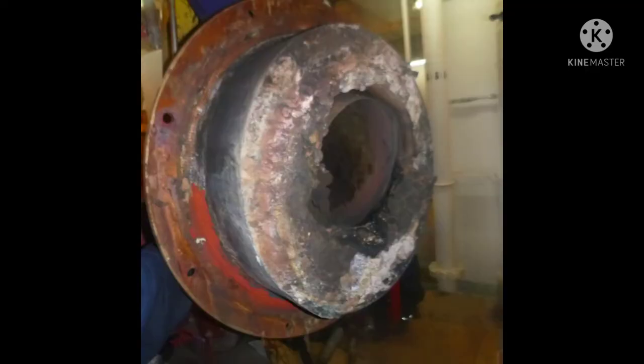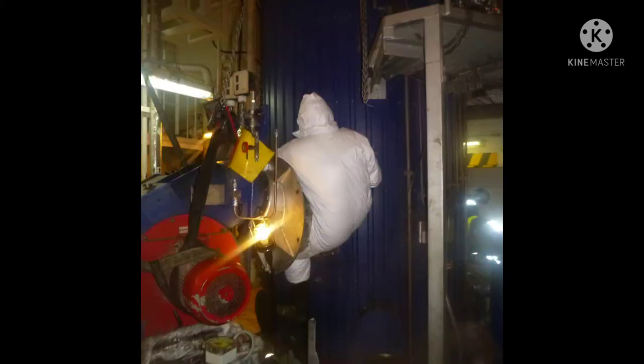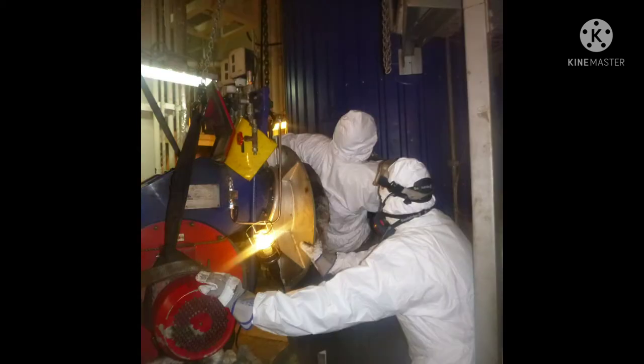When we opened the burner tube, the refractory was already in damaged condition and more than 70% of the tubes were choked by soot deposits. Even when the boiler is completely cooled down, a person cannot stand more than 10 minutes inside. So the whole engine crew, as a team, one person at a time, went inside one by one.